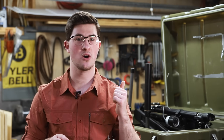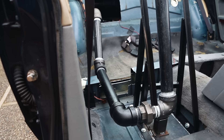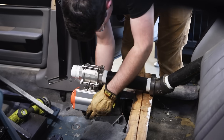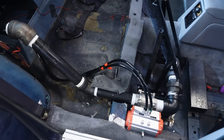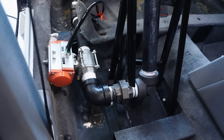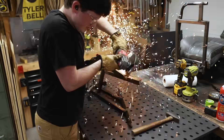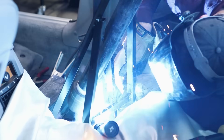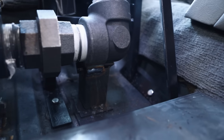I took these lessons and went back home to basically rebuild everything. With the valve next to the tank, by the time the air reached the chair it had filled up all this extra volume, which lowered the air pressure. By moving the valve next to the chair, I got all that extra volume to store air, and I didn't have that pressure drop by the time it started acting on the chair. I also totally disassembled the guide rail so I could angle the chair back a few more degrees, and most importantly, I welded the cannon tube to the floor so it couldn't pivot and allow the chair to tip forward.